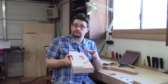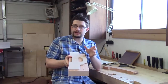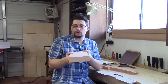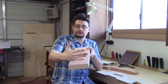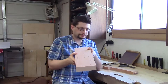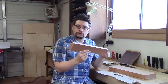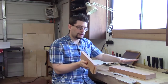It's going to be too long for the chair and we're okay with that. Basically what we're looking to do afterwards is, after we've created the shape and cut our mortises, we're going to cut it to length with the angles that match the top of the leg in our chair, and we'll pull those angles directly off the chair. I also have our rear apron here and we're going to mark this out for mortises as well as our crest rail.